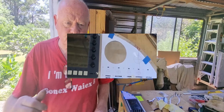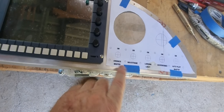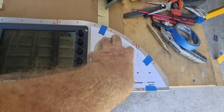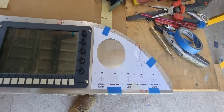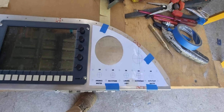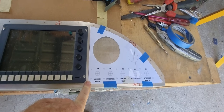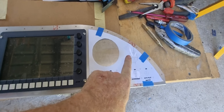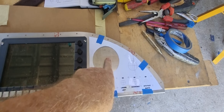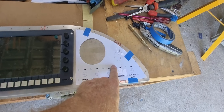Starting on the right-hand side - these pieces of paper I've drawn to scale, so the wording you see here, the 'on' and the 'avionics master', are all done to scale. This drawing file will be sent off to the guy in Melbourne; he will then use this in his laser cutting and CNC machine and cut these at 1mm or 1.5mm in a matte black perspex - a very matte finish. These plates will then sit on top of the aluminium part of the panel, and the holes will be already cut into the perspex and aluminium, so the VX16 radio, the 12-volt display, and any of the toggles including the toggle guards will pass through.